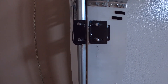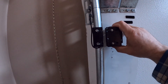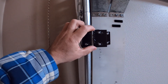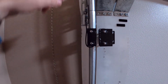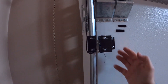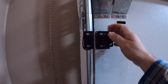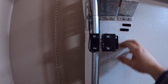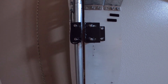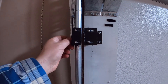Next Garage uses a wired or wireless door locator — a magnetic sensor that you'll mount to the door itself and also in a fixed position along the track. When your door goes up, it senses that the magnetic connections have broken and sends a wired signal to the unit to let the system know the door is open. I've used a couple of 90-degree plastic connectors that come with the Next device to mount that, and hit it with some silicone because I broke a little plastic from tightening too much. Some newer units have a wireless sender, which works okay if your door does a 90-degree turn at the top — but if you've got a door that goes straight up and down, you'll need a wired device like this type.